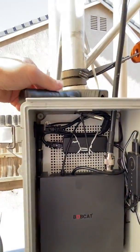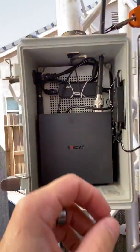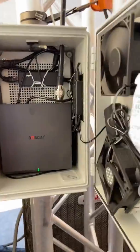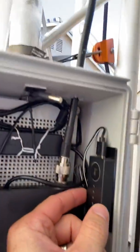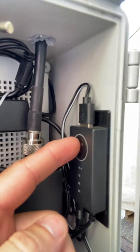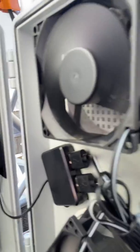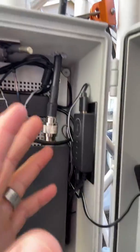I'm going to explain a couple of the parts here and show you how this all works. Essentially, let's talk about airflow. The air comes in through here — it blows fresh air in — and this is the exhaust fan; it takes hot air and blows it out of the enclosure. This also sucks up any moisture, which isn't a problem when it's 100 plus degrees out. These are USB powered. This is my thermoboard — this is what allows me to actually set the temperature. I can set this to 96 degrees to run all the time, completely turn it off, or once it reaches 84 degrees both fans will kick on. I like to keep it at 92. This is really easy and simple — I just took some 3M adhesive tape and adhered it here, and it holds just fine.